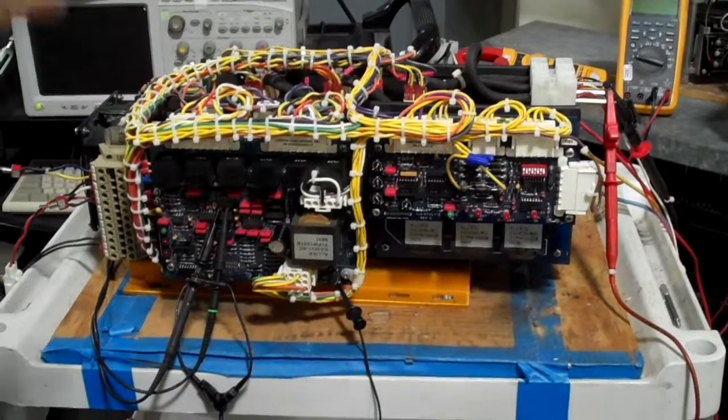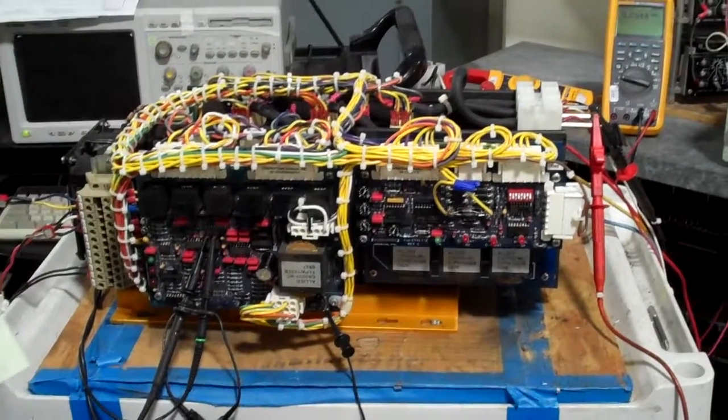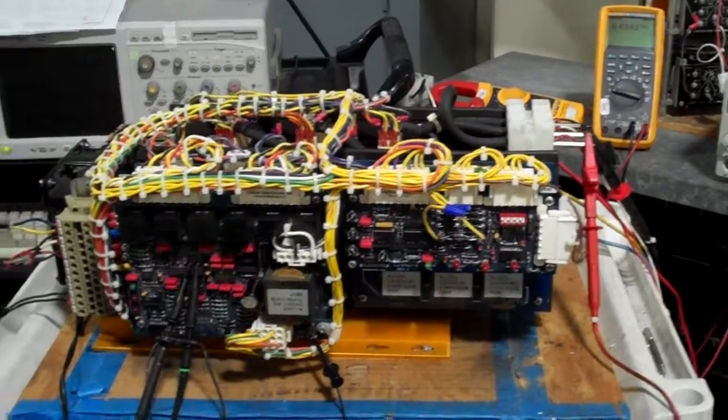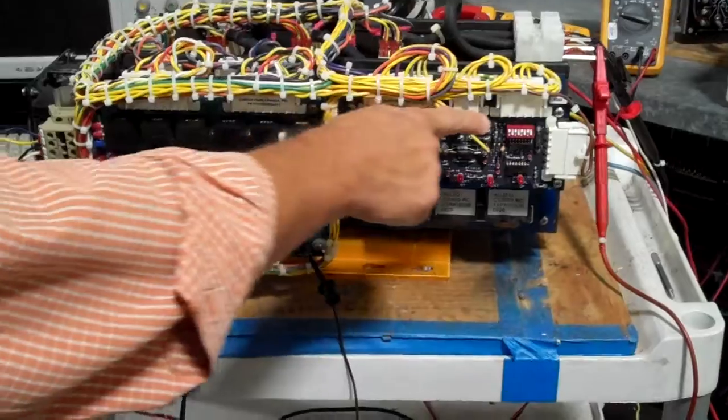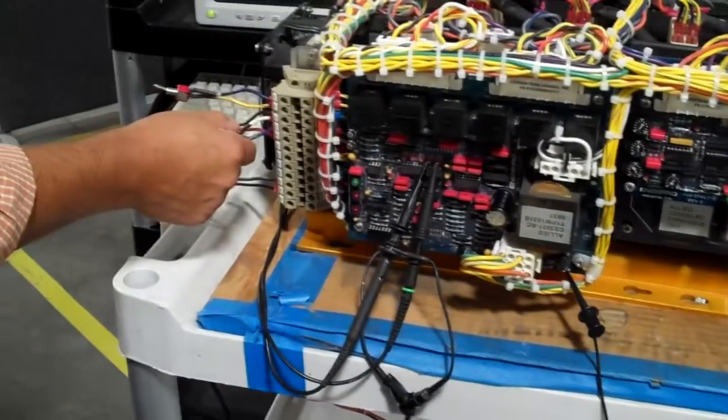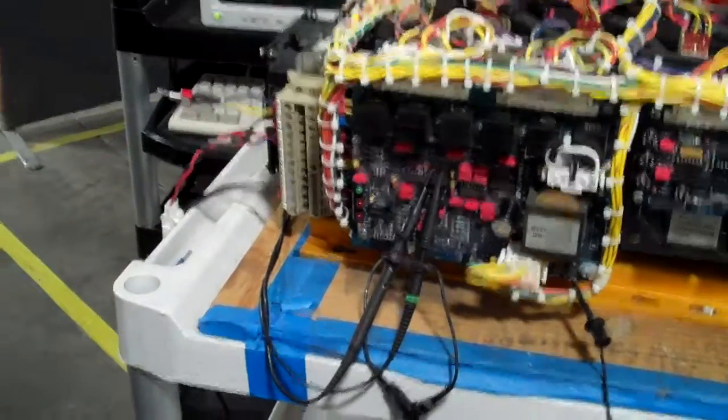This is RMA 18-099 for Enbridge. We just received the unit. We inspected it and noticed a couple of wire nuts here. We also noticed we had a jumper where we usually use the switch, so we replaced that for testing.